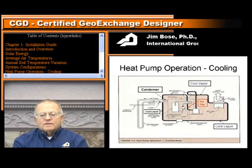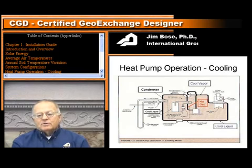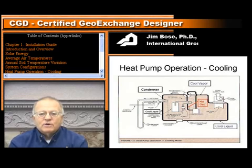And loop number 4 is the domestic hot water loop, which takes water from the domestic hot water tank through to the water refrigerant or desuperheated coil and heats that. Now we have it as optional on this particular drawing, but in most residences and residential equipment, all systems would have that, and that's probably not an option that you would want to give to your customer, because that's a real money maker for them.